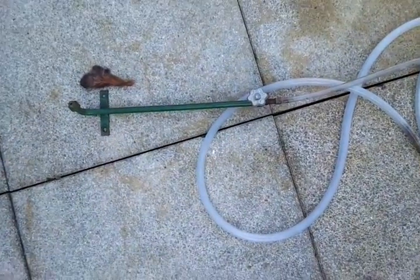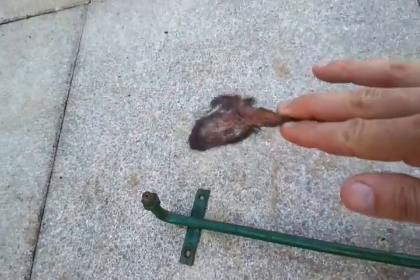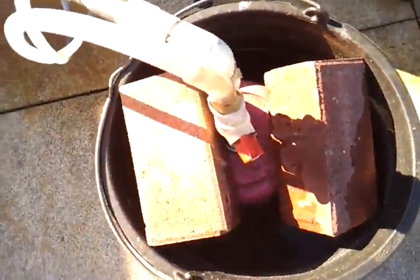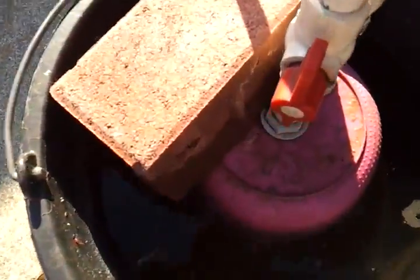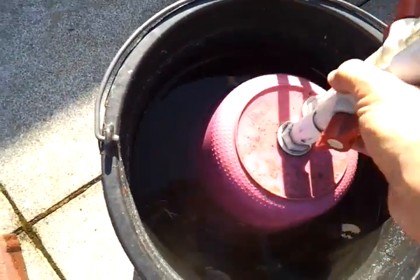Here's what we have going: this metal piece, this brass wool. I've also got a piece in the tube here, and that piece acts as a flashback arrester so there won't be any flame going back up into the hydrogen tank. The hydrogen tank is just a bucket.